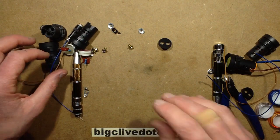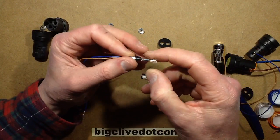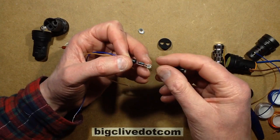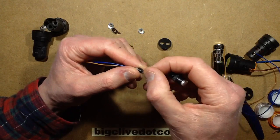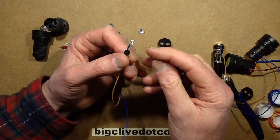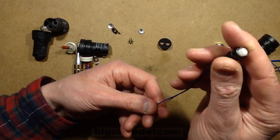And to me, that means this little indicator is going to get pretty toasty, and it's going to heat the LED up. Although they do have the resistor in the positive lead, which is better. Well, the positive lead isn't really 100% the positive in a bipolar LED, but they've not got it in the cup that holds the LEDs, so that's going to at least give some heat separation. But again, I'm not overly thrilled at the idea. I think I'd rather not use small indicators. I'd just rather use big ones.